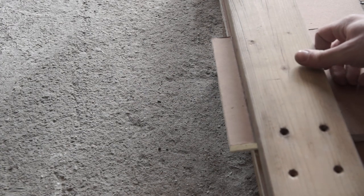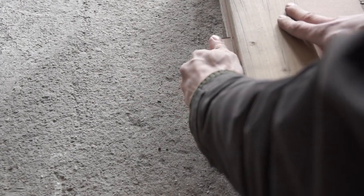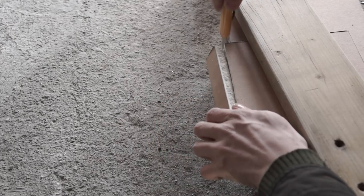Also, another drawback of this board is that making small trim cuts is hard, because bending only a small sliver of the board evenly off the main piece is difficult. And also that may crack the board in the wrong place. So plan the cuts in a way that you don't have to make smaller trim cuts. For smaller cuts, I used a piece of wood to help get the pressure evenly across the piece, so that it would bend in the right place.